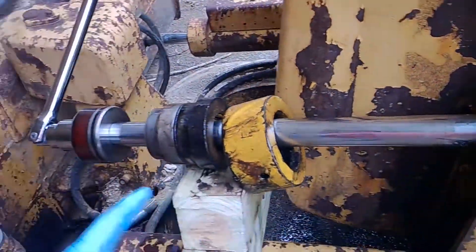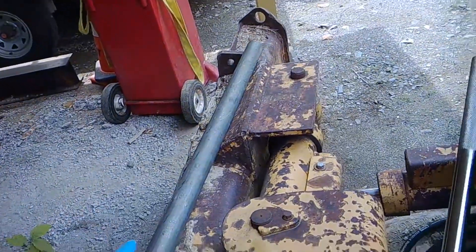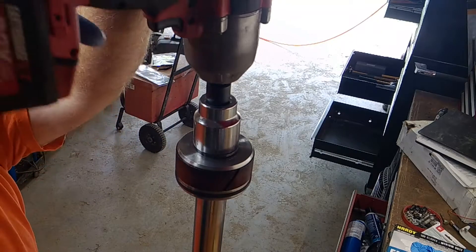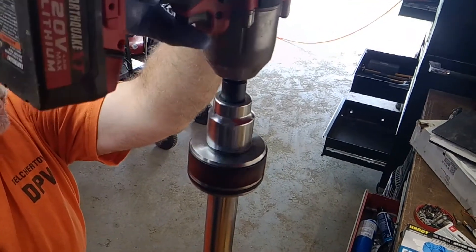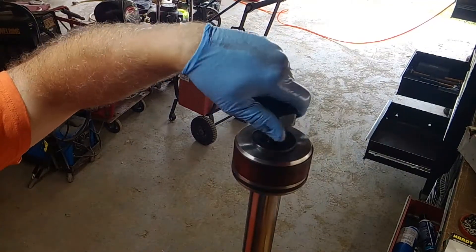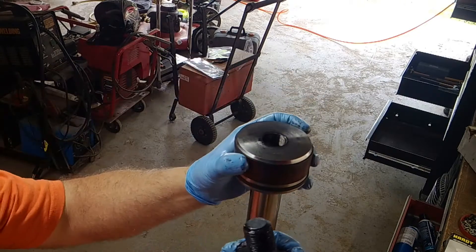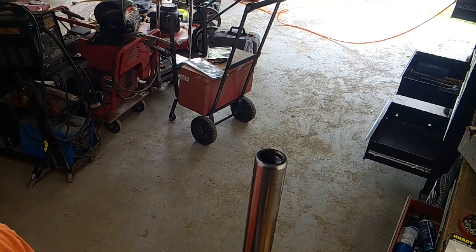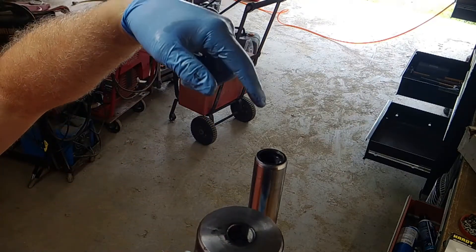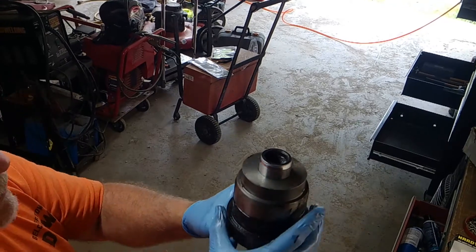Now I'm going to use this inch-and-a-half breaker bar socket — probably have to put a persuader on the end of it because these are super tight. Take the washer off with it. There's gear lube that goes inside where this bolt is, so that's why you want to stand these up and keep that gear lube in there. When you take it apart it's really best to keep everything the way it came off so there's no guessing game. We got to clean them next.